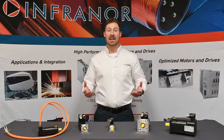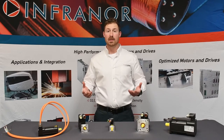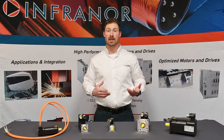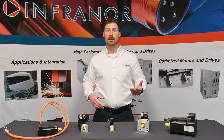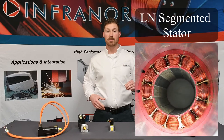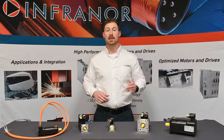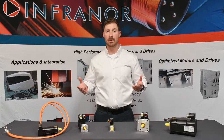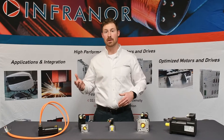The LN and LT series are three phase synchronous brushless servomotors. Both motor families are based on the traditional slotted stator design but with slight differences. The LN series has a segmented stator design that allows for a highly compact motor profile providing high power and torque density. It comes in 6 and 10 pole variants and this series is great for a vast majority of applications including those that need high torque and limited real estate.